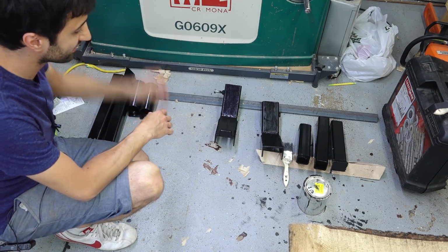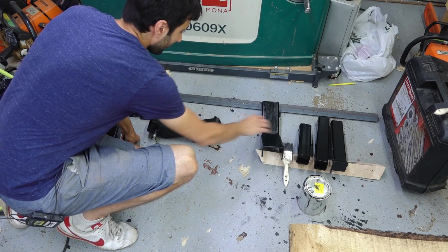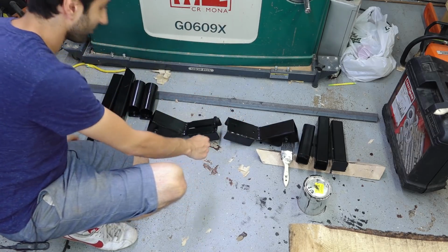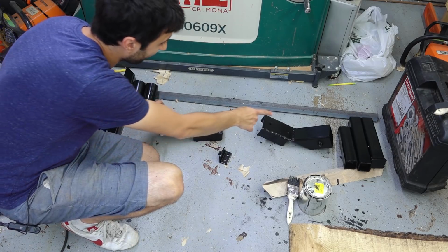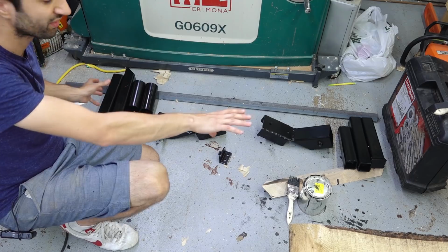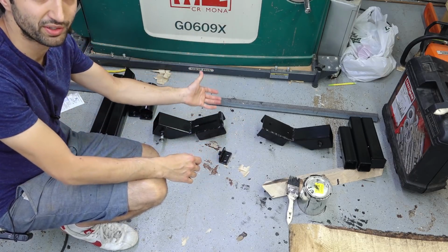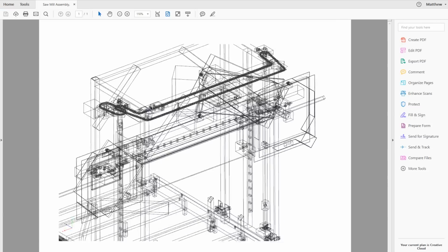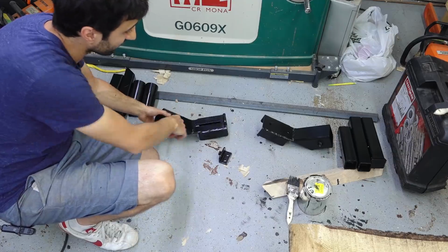And the 3 parts that I made this week for the lift mechanism are this guy, and where'd the other one go? And this guy. So this part and that part over there will help to redirect the chain to the outside front corners of the carriage to leave the top cavity of the carriage open so the motor can kind of come up through the top of the whole carriage. And so the sprockets will go on to these mounting bolts out here.